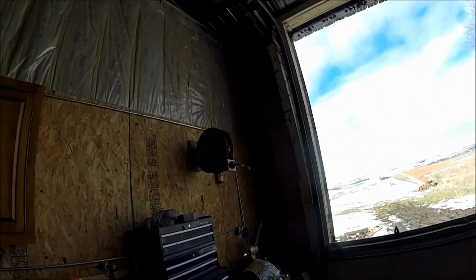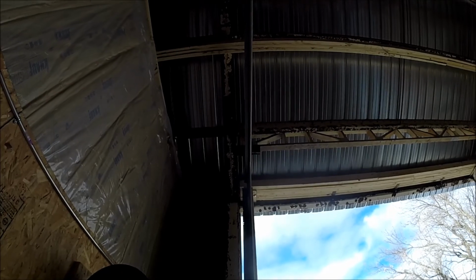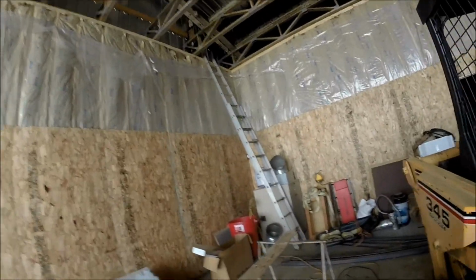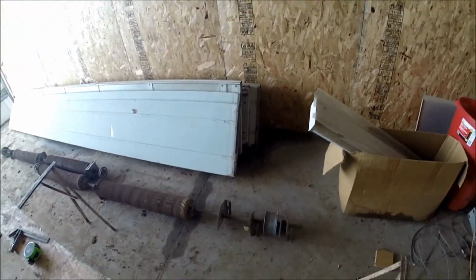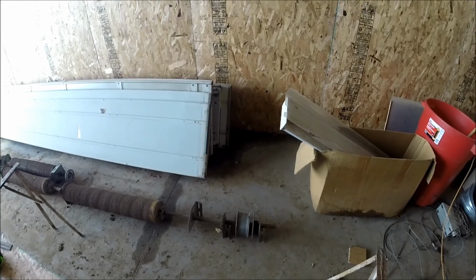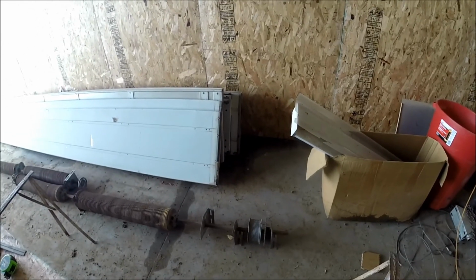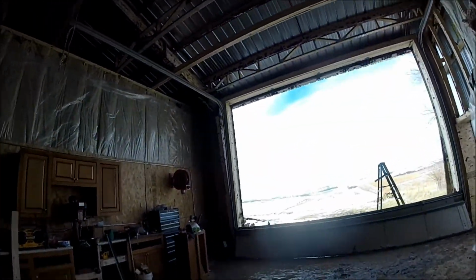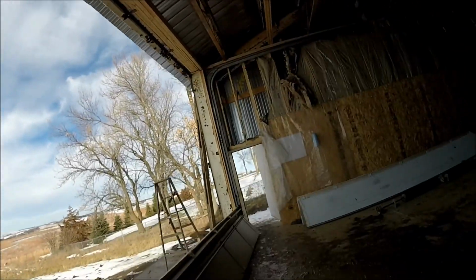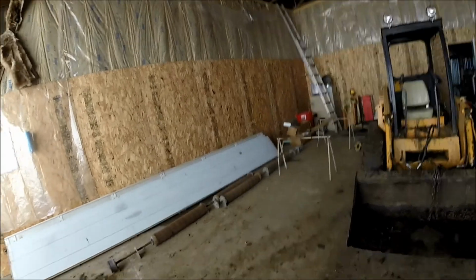And then we're gonna have the same problem on this side. Once again, I don't know how well you'll be able to see this, but the drum will fit just fine on this side, but that's the side that the chain hoist goes on. And so on that side, we've also got that sprocket right there. Now that sprocket can be shoved over a little bit further if I can get it knocked loose on that rod, which may be a chore in itself. But that may be doable, but then we have to fit that hoist in between the track and the pier for the rafter over here. If you can see where those holes are up there, there's 4 round holes, and I don't think it's gonna fit. So we can slide it over some, but then the chain's not gonna line up right, and so that's gonna have to be addressed.